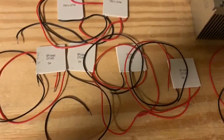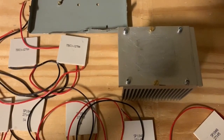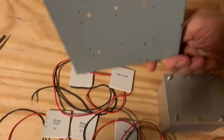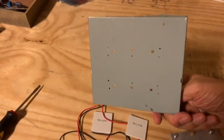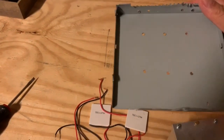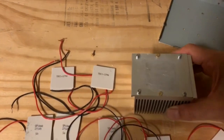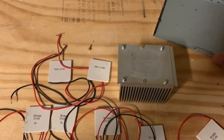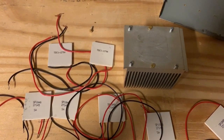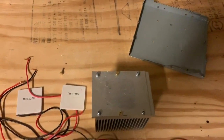Now let me tell you how I'm going to do this. I have a large heat sink that I got out of a computer power supply right here, and I have one side of a computer power supply case that I've cut open, and I'm going to use this as my heating element. So let's begin our project. In order to do this properly, we're going to need to use plenty of thermal paste so we get good thermal coupling between the modules, the heat sinks, and the heating portion, which is this portion.